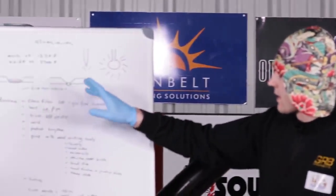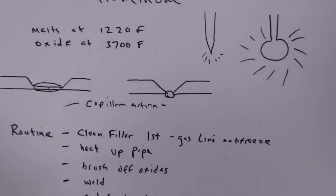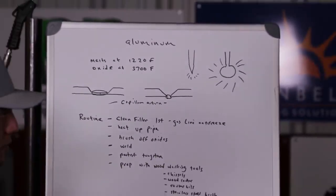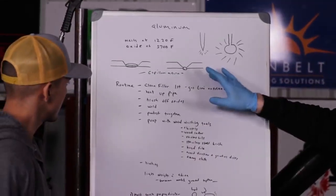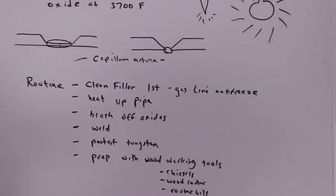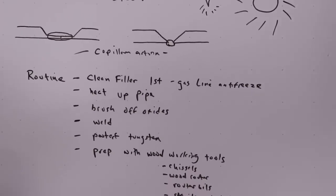Also, the butt weld will have a normal, typical butt weld. I'll be using a 1/8 gap in the video and a 1/8 filler metal. I'll have the filler metal on the outside of the pipe, so I'll be dabbing in on the outside of the pipe there, and the root pass will be going in via capillary action, but that particular pipe will be purged. Also in the video, I'll be using a 2% lanthanated tungsten with a sharp point, so the arc is a lot more focused when I do the root pass.